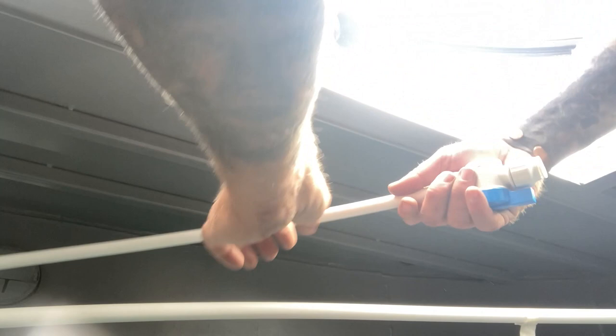Cold feed. So what I'm going to do is just put one of these in line with it, just to connect those together. That's all. So where do I put that? Oh, it's on there. So cold feed up there to that one will go hot water, the other side to the shower. So there's two hot waters there. Cold in, cold out. That sounds about right.